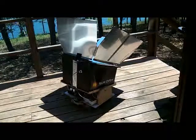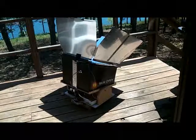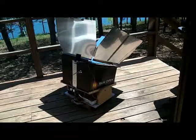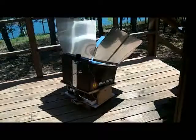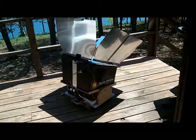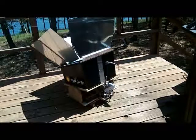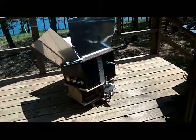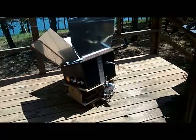You can see it moving up, and it's going to go a little more because I had it off a bit. I do have a delay in between because I don't want to stress the chip that drives the stepper motor. Once it's to a very neutral position, that will stop and then we'll continue. Now I've got the oven programmed for 225 degrees, which is pretty low. It's probably almost there, but I want to demonstrate that when it gets to 225, it moves 90 degrees back toward the east and waits for the temperature to drop off a bit, and then it will return to where it was. The oven has just moved 90 degrees east. It'll stay there for at least one minute, and then it reads the temperature once a minute until the temperature drops off.